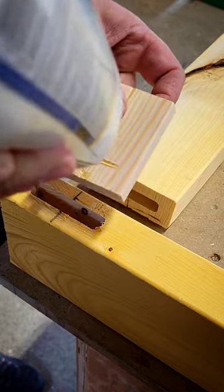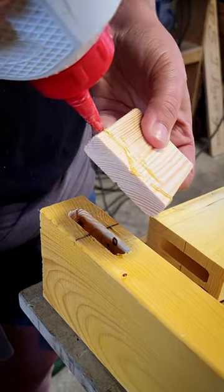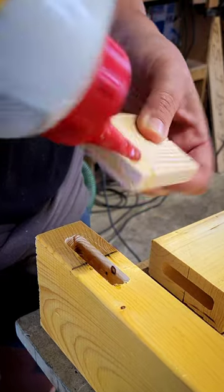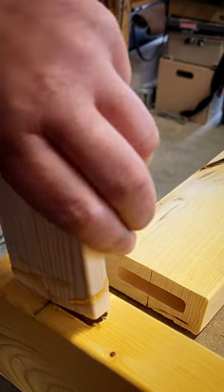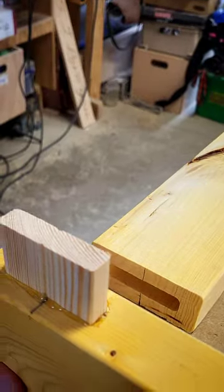You can see we're using some polyurethane glue — PU glue — which is waterproof and rated for outdoor use. We put a tiny little bit in the hole, and then the rest goes on the actual loose tenon that goes in there. I say 'loose' — it's not particularly loose. As you'll see, that is that simple — that's how we make them.